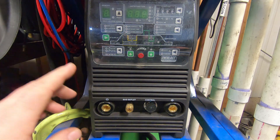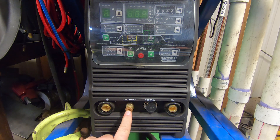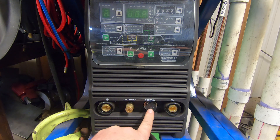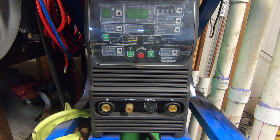The first connection you have is your negative lead connection. Then you have your argon gas outlet. Then you have your control port — this would be for a finger switch, a torch switch, a variable amperage switch, or in our case a foot pedal. Then you have your positive outlet. Things are going to get a little weird here if you're familiar with electronics, because it kind of goes against what you know about positive versus negative.